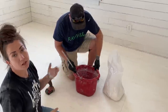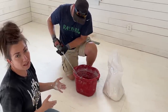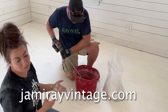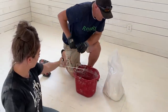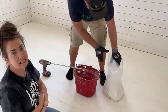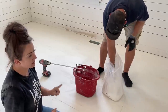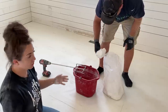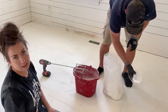So we are mixing up snow white milk paint. It is Farmhouse Finishes — you can pick this up at jamierayvintage.com. You're going to mix it up to one part water to one part paint. We're going to try the ginormous mixer here because we have to mix lots and lots. We chose this paint because it sticks well and it is traditionally what was used on older homes a hundred years ago. It's all natural — it's even food safe.